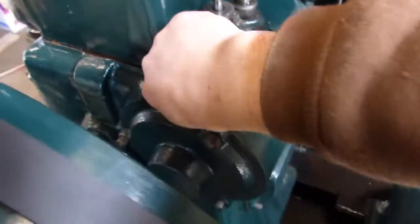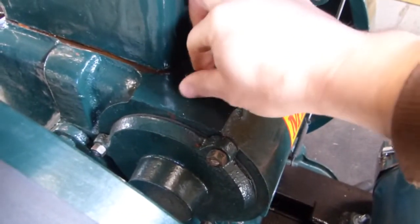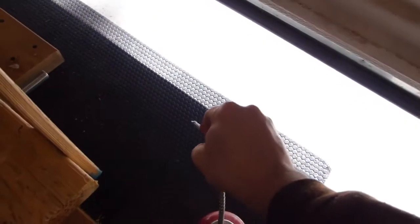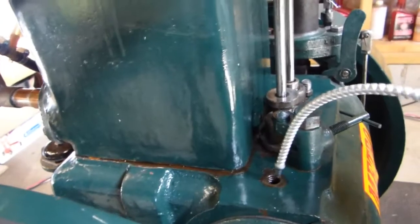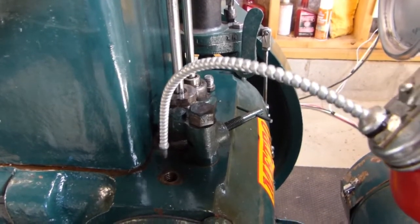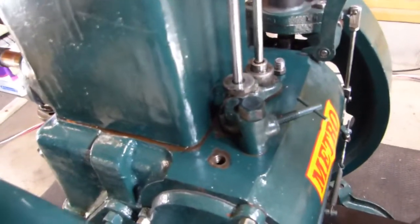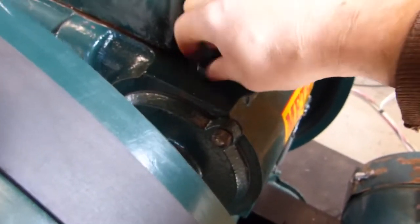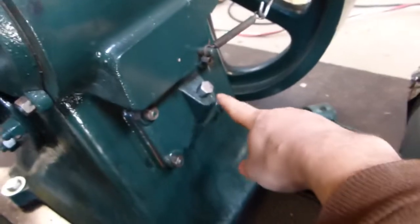Those tappet stems are lubed from the inside once the engine's running, but it takes a little while to get them going. Now this bolt right here, the original Listers had an oil pump inside that lubed one of the cam bearings on this end. But the splash lube Indian ones don't. So you take the stem and you bend it down just a touch, and you just send a little bit of oil straight down. One, two. And it fills up a little funnel cup inside that theoretically is supposed to be lubricated while the engine's running. But you just don't want to start it off dry. And then you put this back in, hand tight is good enough. Now, I just ran this the other day, so I do know the oil level is good. If you're in doubt, you can pull this out. There's the dipstick. And you're pretty much good to go at this point.